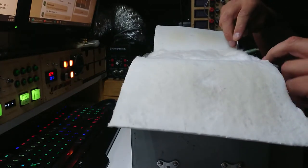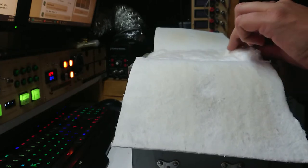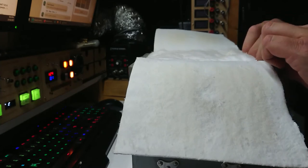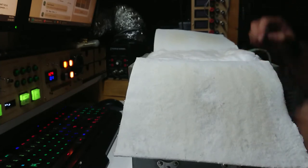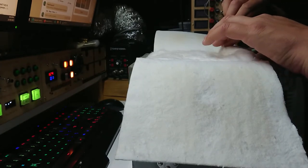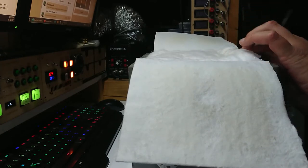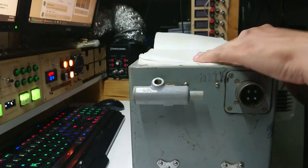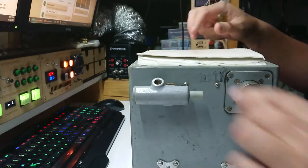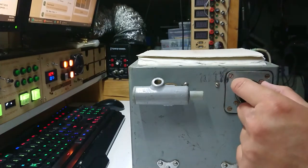At some point we'll find our heating elements. This actually feels a lot like asbestos. I think I might put this cap back on and use the multimeter instead. Yeah, it's got that old tank feel. There's definitely asbestos underneath that — this is not fibreglass. So I think this is going to get packed back in here and stabilized. I don't want that all over my workshop. We'll do it a different way — maybe take the socket out and see what's connected to that.